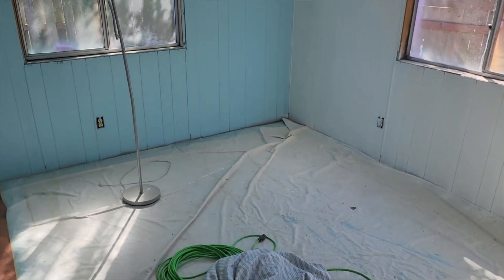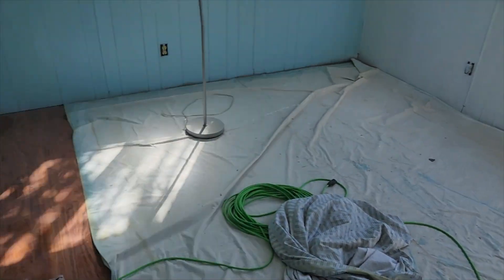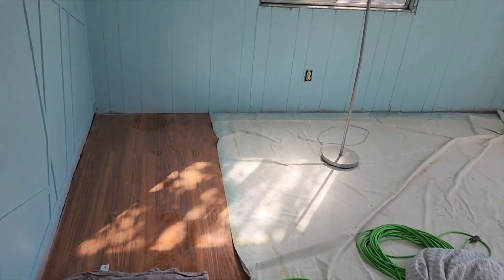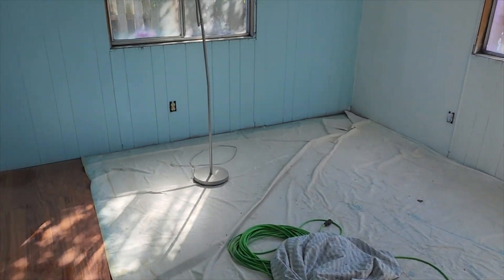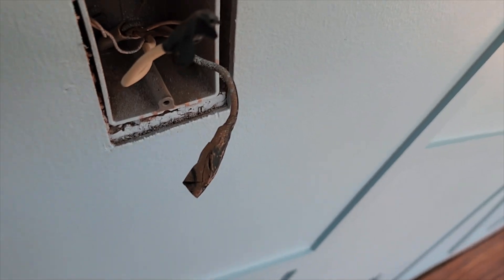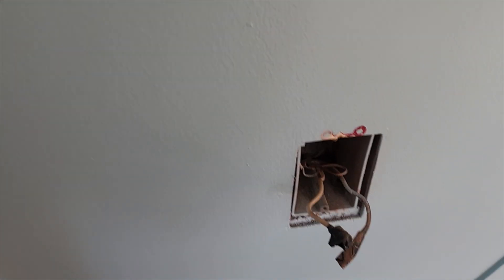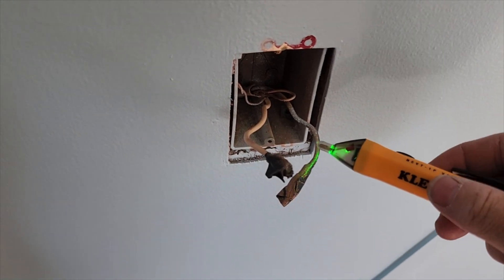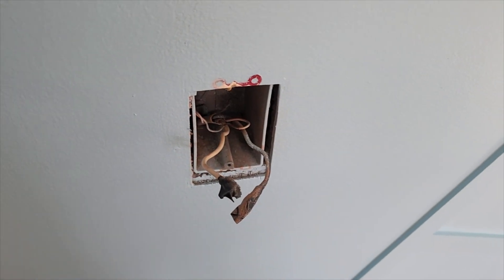In this room there's no overhead light, so there's an outlet on each wall — one back there, one down here — and a light switch. We tried plugging a lamp in to see if one of these was a switched outlet. I pulled the light switch out and found it not even hooked up, with the hot and neutral just taped off. Let me check for power — and we do have a hot wire right there. So I need to figure out where this white wire goes and what it controls.